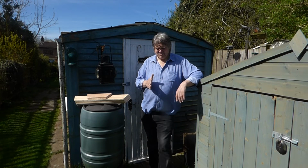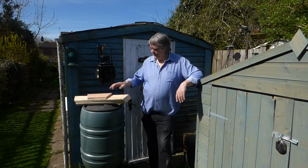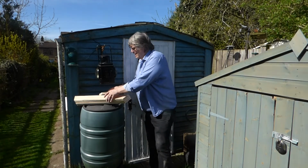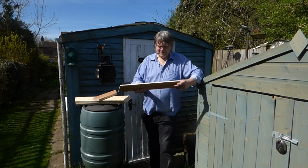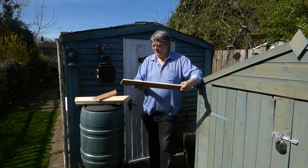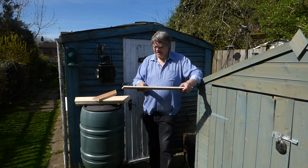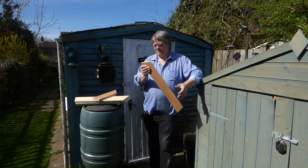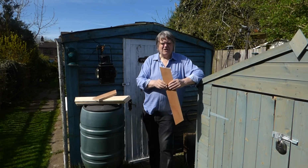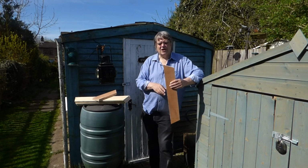I haven't got a bench saw, so I've used the circular saw, and although I hopefully kept to the lines as accurately as I could, you do get a little bit of wobbling. So when you put the strips in the mitre saw, every little deviation throws you out. So when it came to cutting the mitres, although these should be 22.5 degrees, some of them aren't. So it doesn't go down as clean as I hoped.